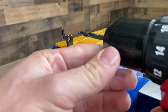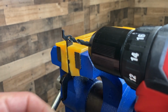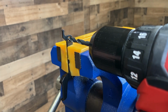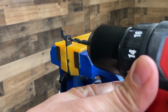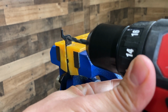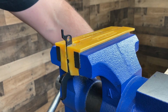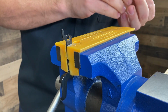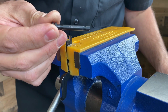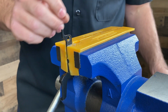And using our drill, we're going to use the countersunk side of the bolt stop and slowly start our drill into the countersunk hole and just chase through. Once you've drilled through the bolt stop, we can verify pin sizes again. So that would be the factory pin. And now we'll check our HBI spec pin and notice that it passes freely through the bolt stop.